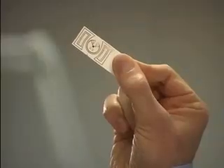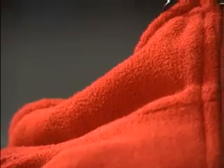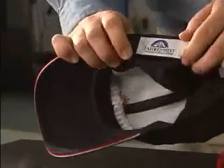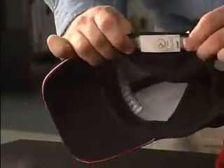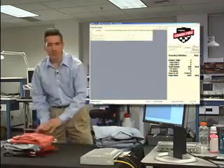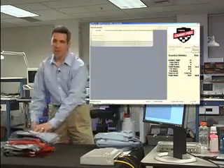Another item-level application is tagging garments. This little tag antenna design, which we call satellite, is ideal for tagging a variety of apparel, from shirts to caps. Because we're using UHF RFID in the near field, it's no problem. I can keep adding garments to the stack and the UHF Gen2 Speedway reader reads them all without any problem.